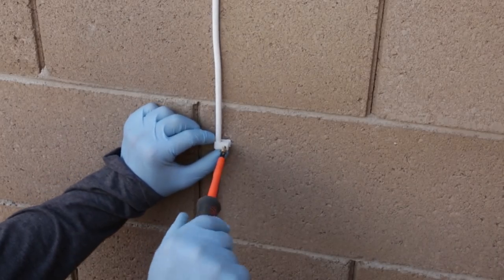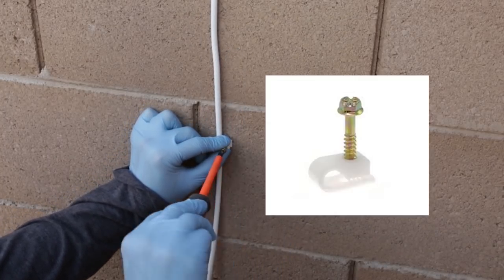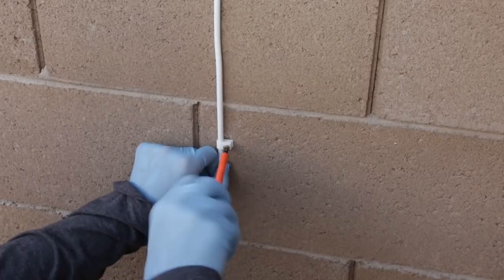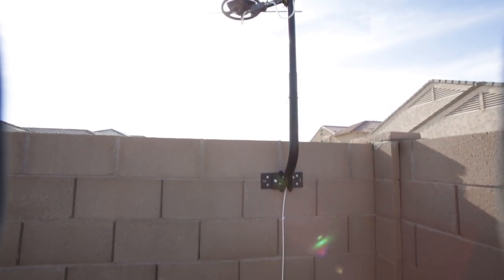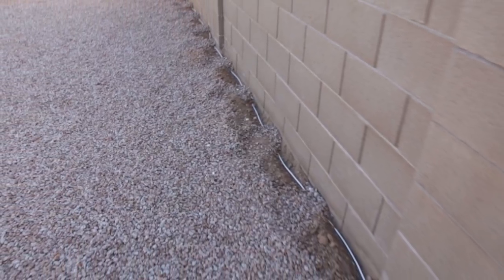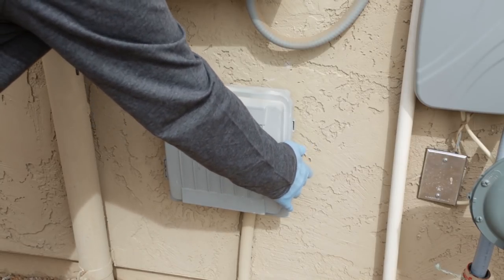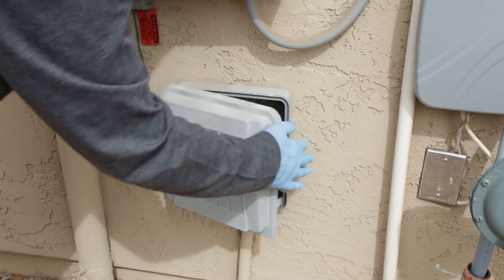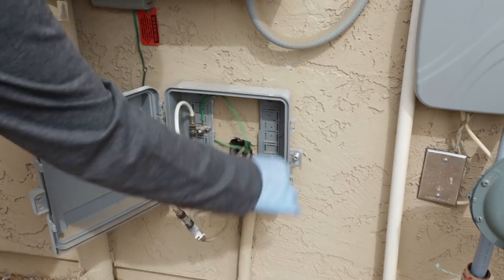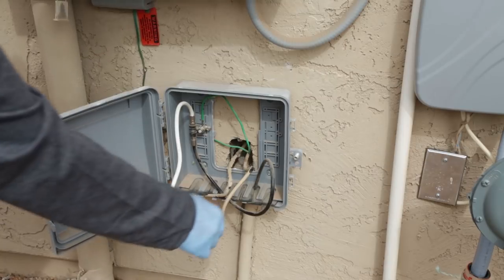In order to keep the cable line straight and to maintain a clean look, it's necessary to use cable clamps when running coaxial cable from the antenna into the home. For this specific installation, we had to drill holes every couple feet down the block wall using the carbide hammer drill bit in order to secure the cable clamps. We then ran cable underground along the base of the wall the rest of the way. If you are switching to free TV from cable, there should be a conduit typically located in a box at the side of the house where the cable company's signal comes up from the ground. Running coax from the antenna to this location allows you to use the pre-existing hardwiring cable in the home.